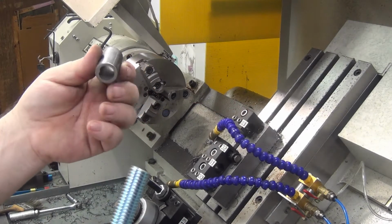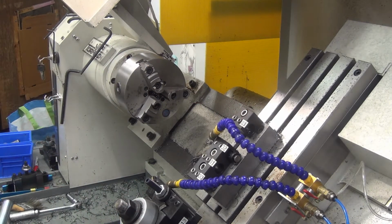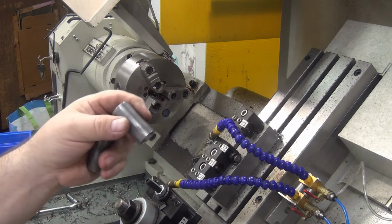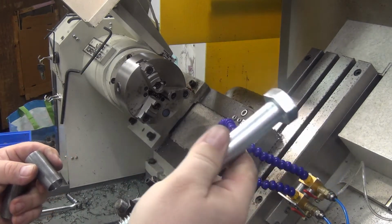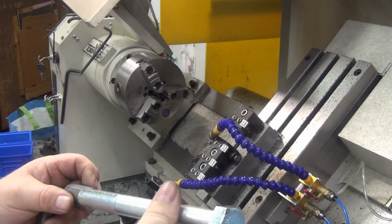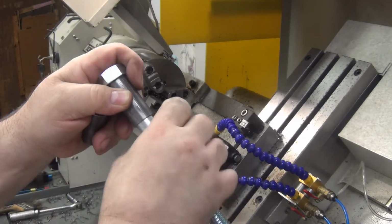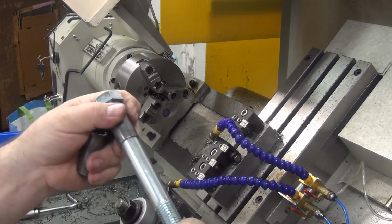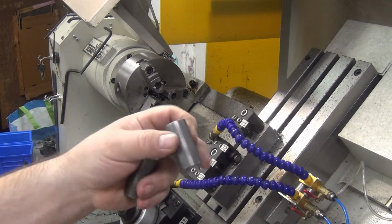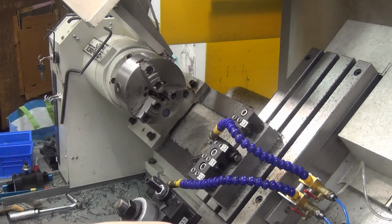What I'm working on right now is I have this DOM. These are becoming tubes, sleeves for the kingpin bushing removal tools, and basically it's a big 3/4 inch, 7-inch long bolt, and that goes on there, and then when you go to remove the top bushing in the spindle, this acts kind of as an alignment, which is why I chose a big bolt instead of just simply taking the tube and trying to hammer the tube onto the bushing to get it out.